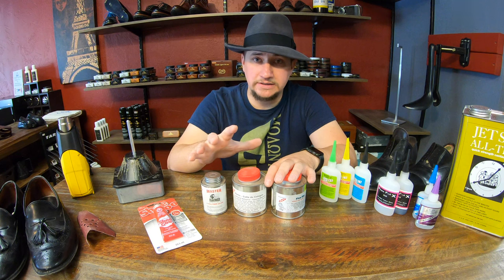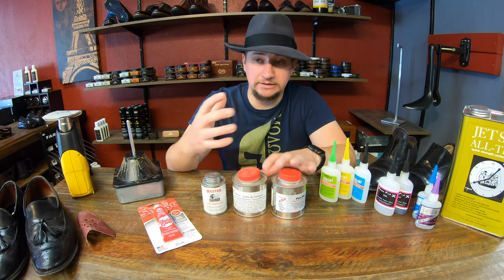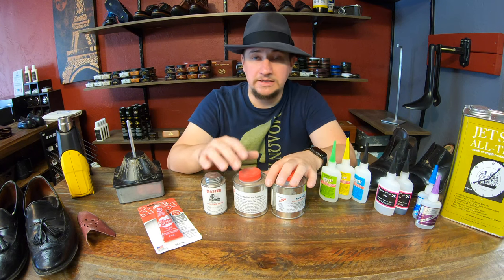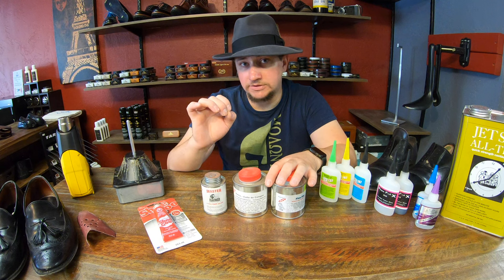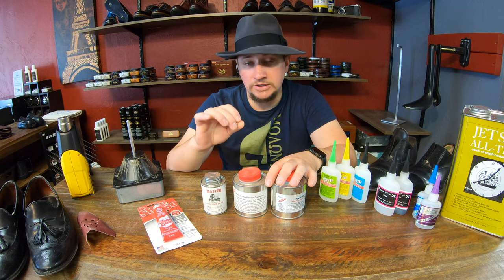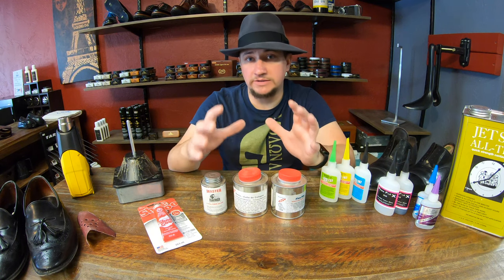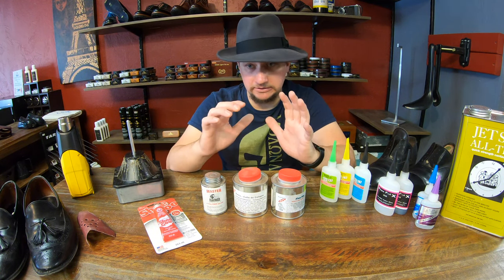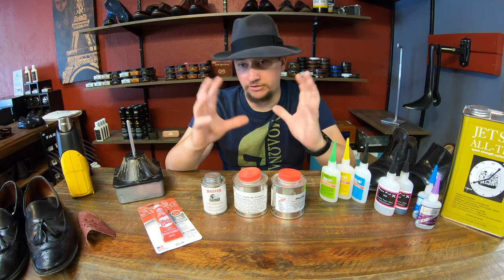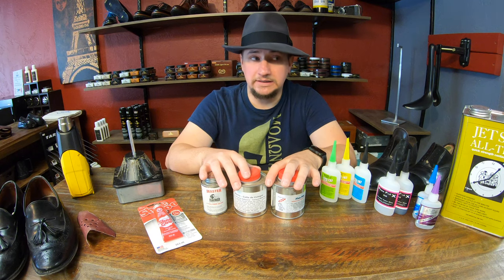The reason why I say Crazy Glue and even Gorilla Glue is because we've had the fire department get after us a few times about it. The fact is that when you start sanding it, the small fibers from Gorilla Glue and Crazy Glue actually clog up our fireproof bags on our machines. Yes, we have fireproof dust collecting bags. That dust is extremely flammable. You take a little bit of fire to it and the whole thing just starts going, and it goes for a while. It's probably one of the best fire starters out there, quite honestly.